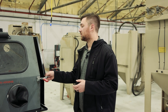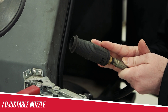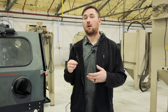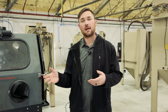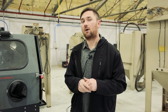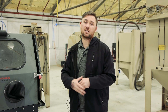The cool thing about this hydro blast is that on the inside here I can pull out this gun, and you're going to have an adjustable nozzle. This puts out a fan spray or a jet spray, which is a huge advantage over pressure washing where you're stuck with one stream of spray. You can adjust between fan or jet spray, and it goes anywhere from 1,200 to 1,700 PSI — variable depending on where you're adjusted.